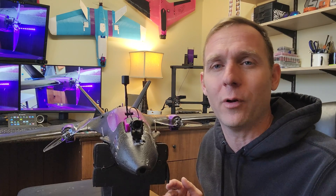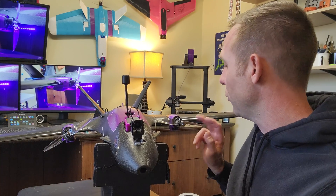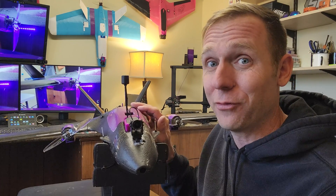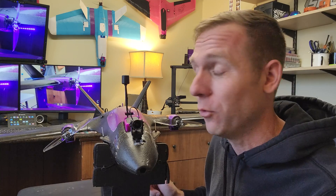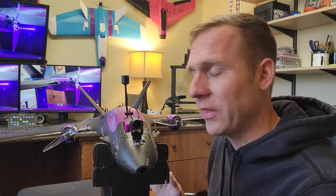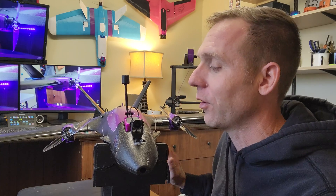It was too windy to do an auto-tune so I didn't mess with it. Also, this setup is intended for 6S — I've got a 6S battery and ESCs on the way. We're leaving for spring break tomorrow so everything will be waiting when I get back. Keep an eye on the channel for the 6S version. The plane seemed a little sluggish with this setup because I chose these motors specifically for the 6S system — wanted to make sure it would fly first.